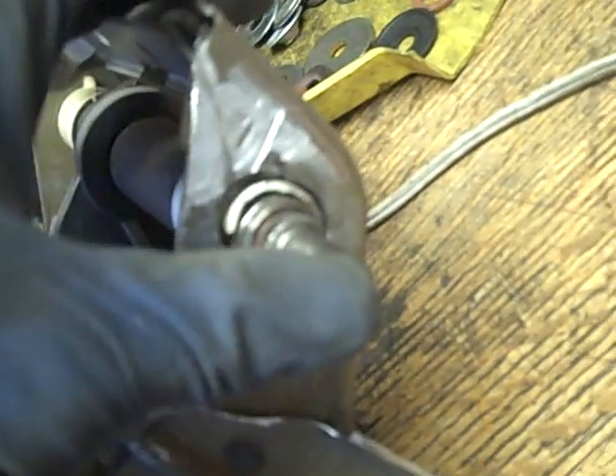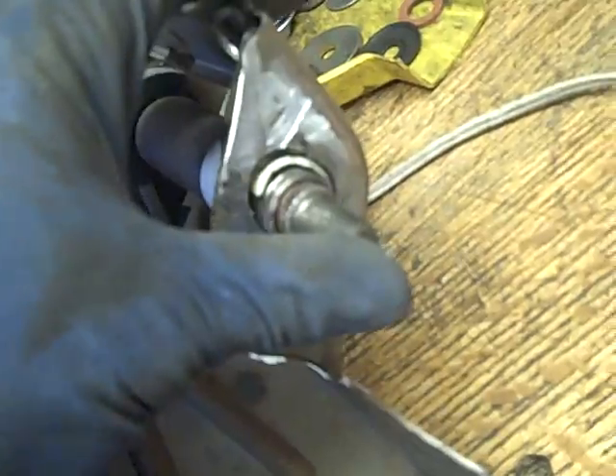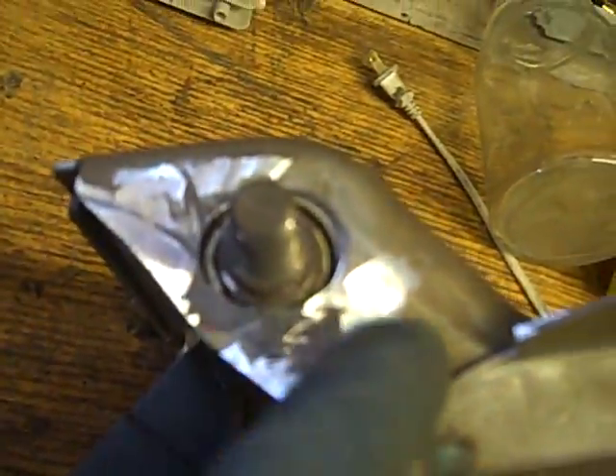This was soaking up a good half inch to three quarters of an inch because of all the play where it's chewed away. So what I've done is scraped all the metal so it's nice and shiny so it'll take a good weld.